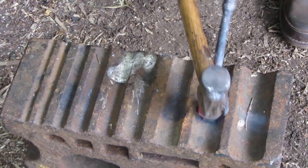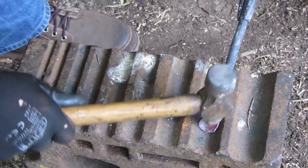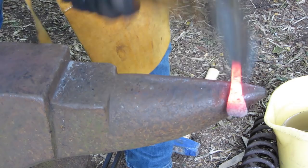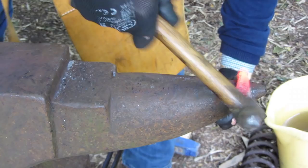I like to use the bellows forge — the bellows are nice and quiet to use, just pedalling away softly. I'm now bending the stem of the spoon shape over the bick of the anvil, trying to rotate the work and keep the hammer blows in the right place. Being nice and hot, the metal's bending quite well.